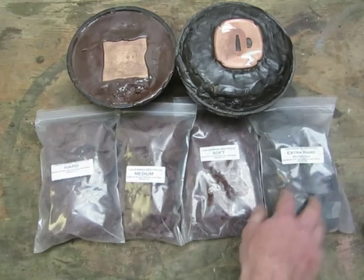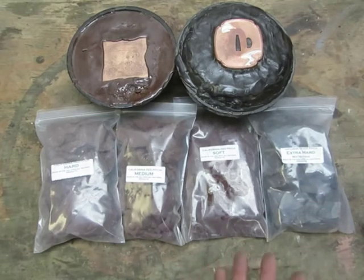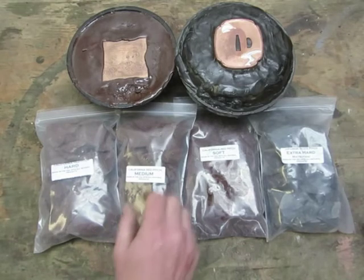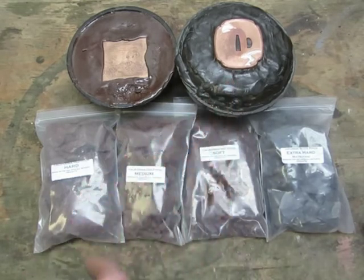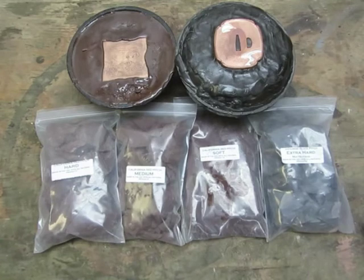The Matsuyane is extremely hard and not really used for repoussé unless you heat it up. The only way you'll get it to move is when you heat it up — you can work it hot, but it's kind of messy. What it's mainly used for is you heat it up, sink your piece in, and it really grabs on. So if you want to do engraving, hammer and chisel engraving, or carving, that's really what this is used for. It creates a really hard, solid backing — mostly used for work holding or the finest detail work.